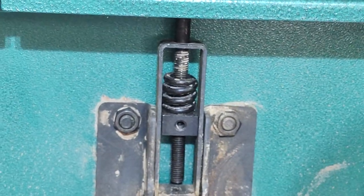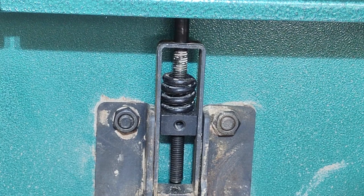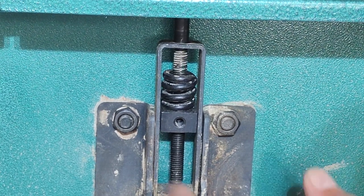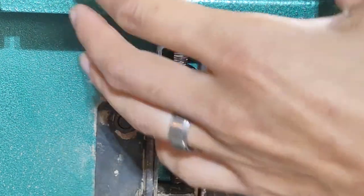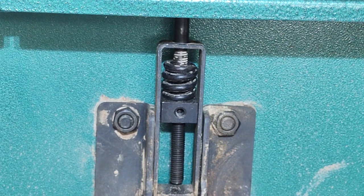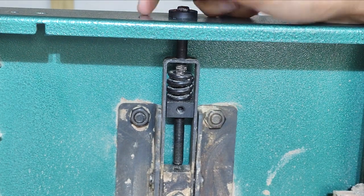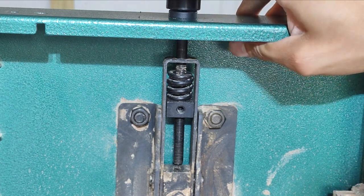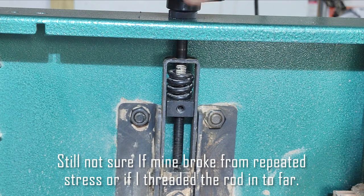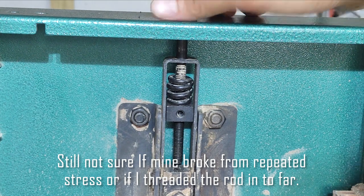See that? There's no residue at all — it just looks like a jagged piece of metal that has snapped. It's asinine to me that this plastic piece is just friction fit on here, because as you tighten the bandsaw and this area moves up, it starts to force the pulley to get your tension. What you end up with is this threaded rod basically pulling down on the handle, pulling it against the top of the machine. And you can very easily just go too far with the threaded rod — and if you do, the handle just pops right off.